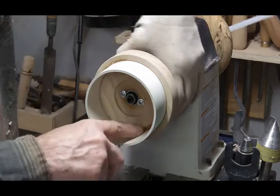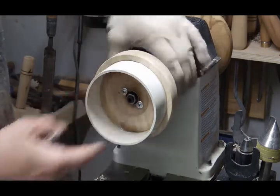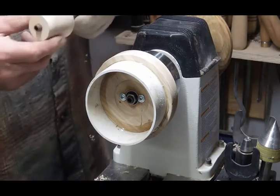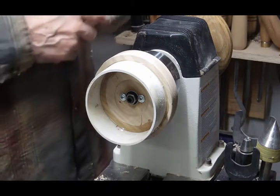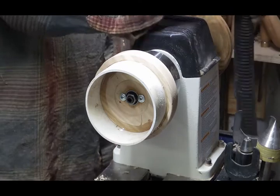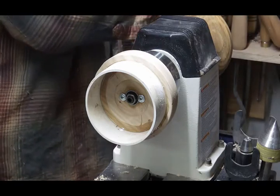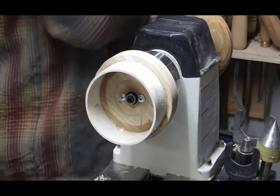Take them out, Dave. Let's clean it up a little bit. Spread it around. Now see, the tube comes out the back. I've made an adapter: a piece of maple, 3/8 copper tube, and some 5/16 fuel line. This end goes into the end of my vacuum hose to the shop vac. Then your plastic tube will just push in there for a tight friction fit.